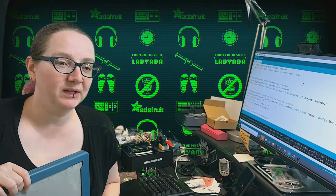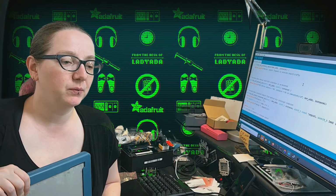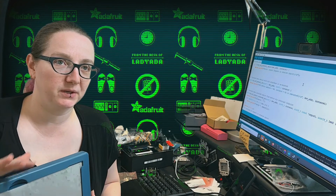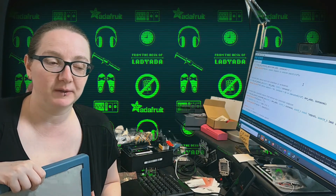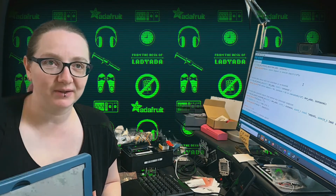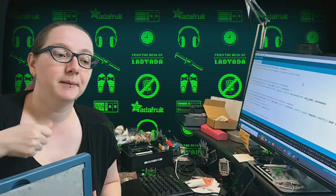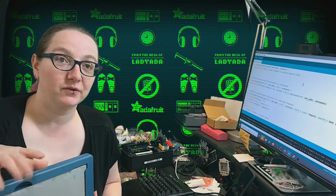What's really interesting about this chip is, I guess at the time, flash memory was really expensive. So the chip had RAM, but no flash. The chip would connect to your computer and say, hi, I'm a new EZ-USB chip, give me your firmware. And the computer would transmit the firmware. It's like a bootloader, but it bootloads every single time. On connect, it bootloads down the firmware, and then it restarts and runs that firmware.